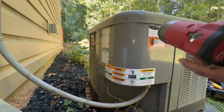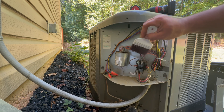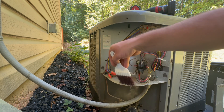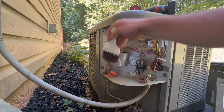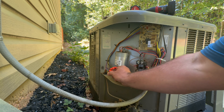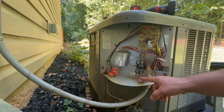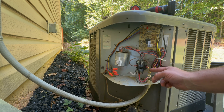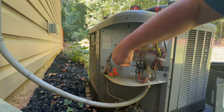From there you pull all your screws off. Check for any buildup or ants while you're doing it. You can always look at all your connections — everything should be nice and tight while you're cleaning it, and make sure you don't disconnect anything. Test all your wire nut leads and make sure everything's nice on the low voltage side. With the disconnect off, verify connections are nice and tight, nice and clean, no nicks, no sections touching on bare metal. Make sure they have a good clean stripping and are nice and tight with the female fittings for your low voltage.